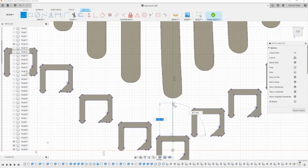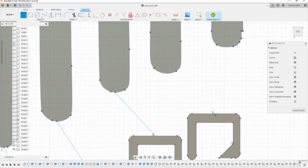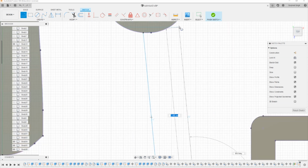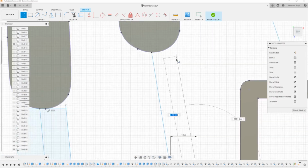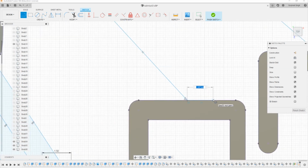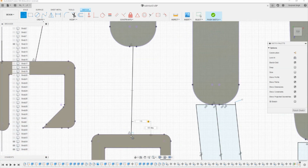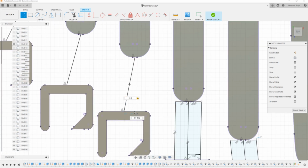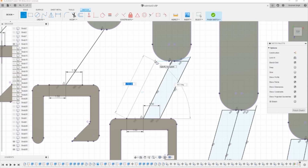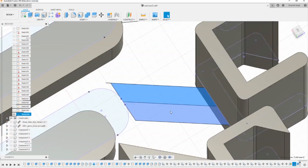So now that we have all 15 of those set up in 3-dimensional space, according to where the linear actuator, or like the straight gear parts are, we're going to make lines going from those individual feet to each individual note of the Kalimba itself. So we can properly customize the angle of each one according to where it is in this virtual Kalimba. And we know for a fact that this virtual Kalimba is correct because we printed it out and we measured it to make sure that it's right.